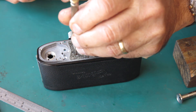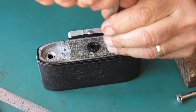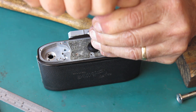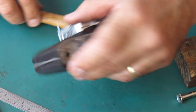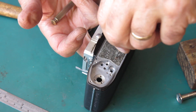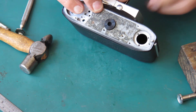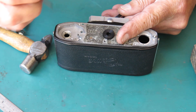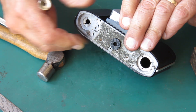What I need is a miniature impact driver, and what I've got is an old screwdriver and a little hammer - and that'll do the job. Just put plenty of torque on the screw with one hand, tap with the other, and the tap is enough to break those screws loose. That one - the bush is just pushed out as I've loosened that up, so the bush is now rotating on the back side.